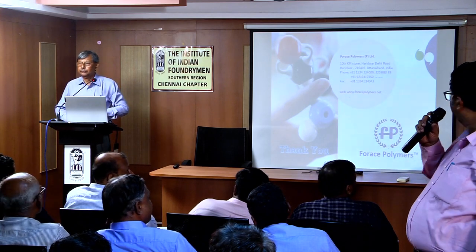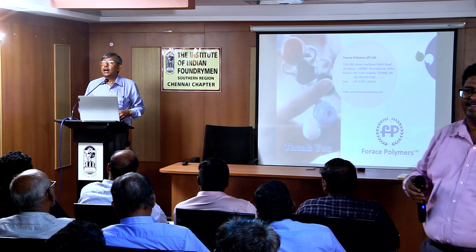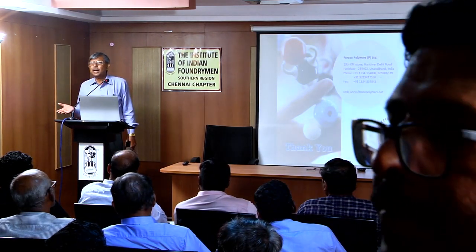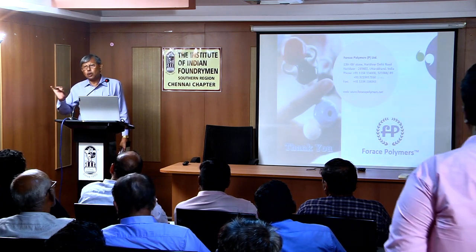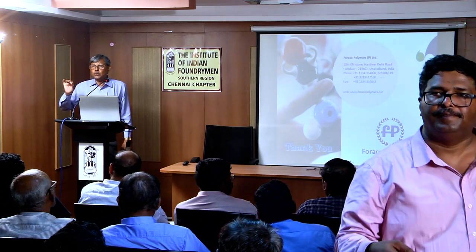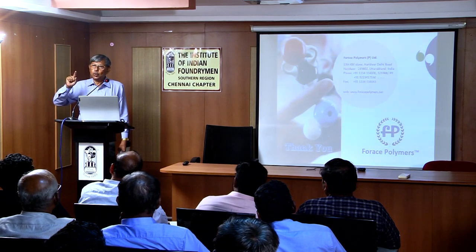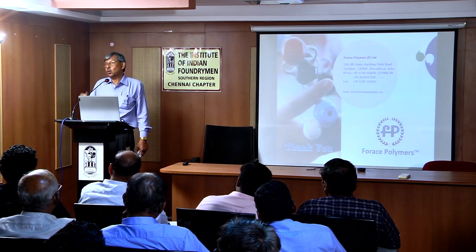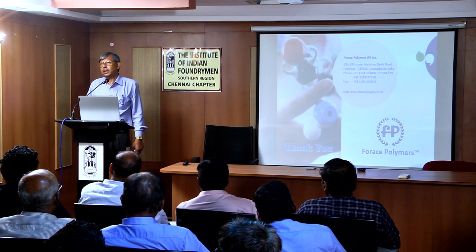Welcome. Any other questions? You are talking about no-bake? Cold box, only thermal reclamation mechanical followed by thermal. People so far use it in iron pipe manufacturing as a socket core. But in green sand foundries, if you want to do it, you have to separate the cores, crush them, and finally it will be thermal.